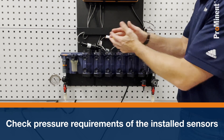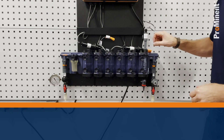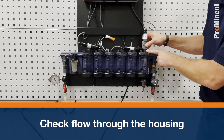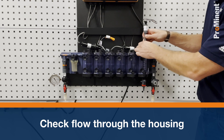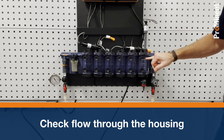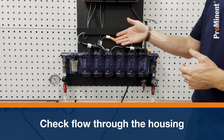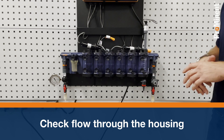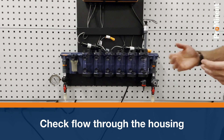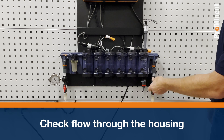The least amount of pressure for these sensors is best, but I still need to have flow running through the cell. Next I'm going to come to my flow switch and loosen it — a little bit of water may come out — then pull up the shaft of the switch and hand-tighten it. The float followed that movement. For amperometric sensors, I usually want to keep flow to around 10 to 11 gallons per hour as a good starting point. We have well more than that going through, so I'm going to come to my needle valve and start tightening clockwise to restrict the flow.